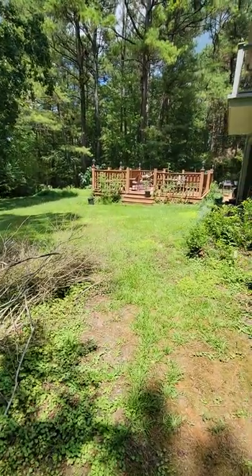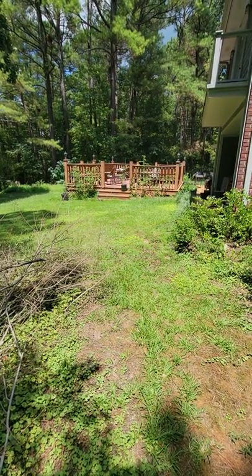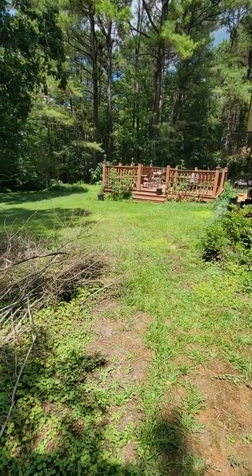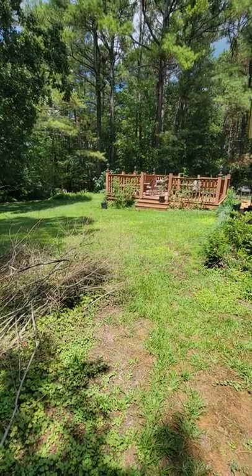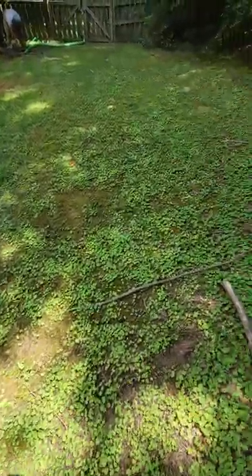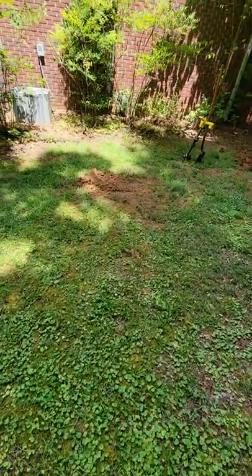The first thing I tell people to do is do a good walk around your house. You're looking for a few key things. Number one, one of those white clean out pipes — I'd love to show you, but this house didn't have one. Up by the house, that's a good indication. You're also looking for a large 5x8-ish dead area over the septic tank — that's going to be for your 1,000-gallon septic tank or so. Or you're looking for little sunken-in indicators, because the ground around the septic tank settles over time.